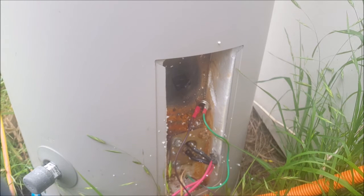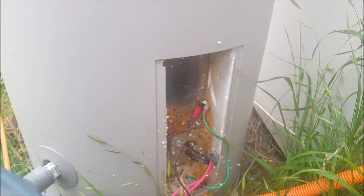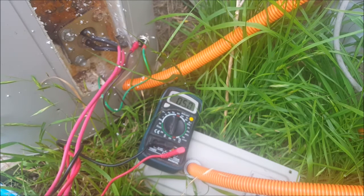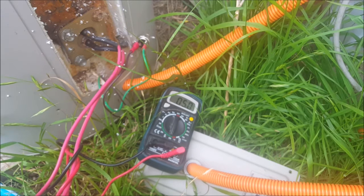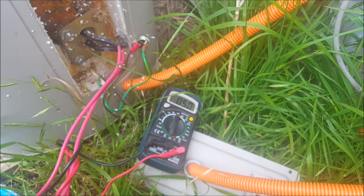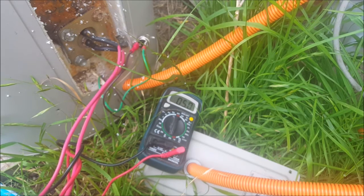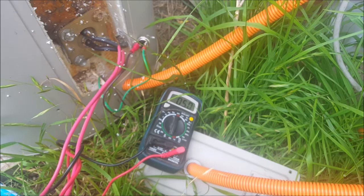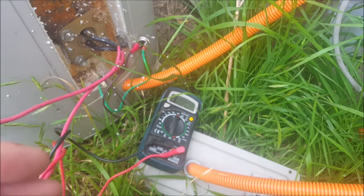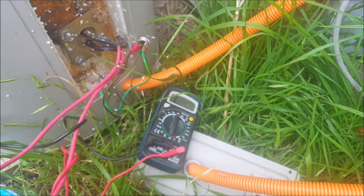I ordered a 48V 600W element. I didn't get it, but I can work with that. Five ohms resistance — at 48V that means I'm only getting 460W out of what should be a 600W element. I've added a third panel to increase the voltage and that should get me up pretty close to 600W.